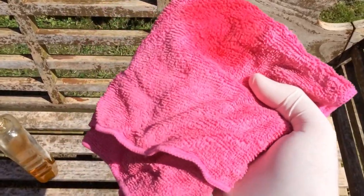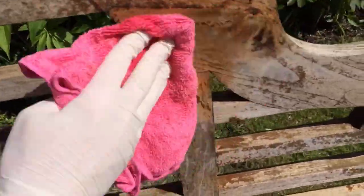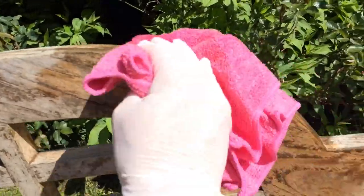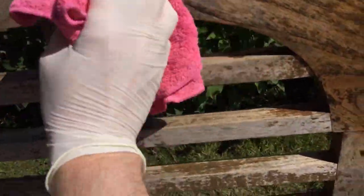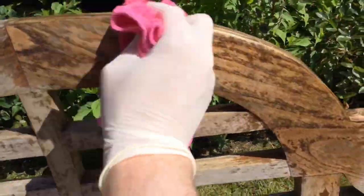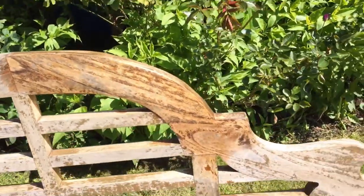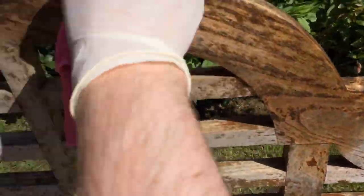Right, so I've got my oil on a piece of cloth, and all you do is just rub it in — give it a good rub in. You can see already it's starting to change colour; it's going that nice rich woody colour, isn't it? Looks good. I'm going to do that all over, and make sure you do underneath the bench as well — any hidden cracks, you want it all to be nice and sealed and weatherproofed. Then I'll let that dry and give it another coat, and that will be the finished product.